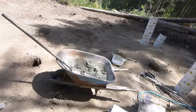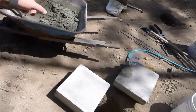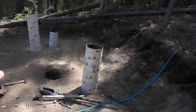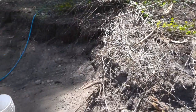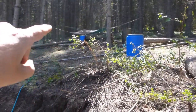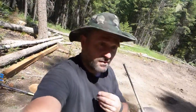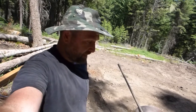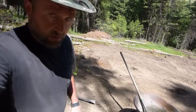We have some concrete mix ready to go. Like I said, I'm going to put just a little bit — an inch or two — in the bottom there, mix it up, make sure it gets in there nice. Then I'll be putting the form in and using the spirit level to get it as level as possible. If you're wondering where I'm getting my water from off-grid, I have some rain barrels up there and some water catchment tarp. A few days ago I had some good rain and managed to fill up all three of those 55-gallon drums in a day, which is good. So right now let's get some concrete mix in there and go from there.